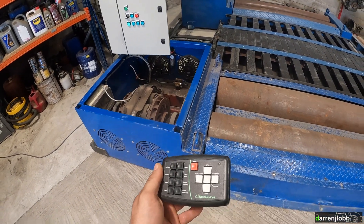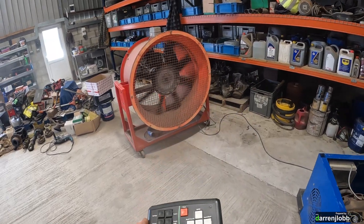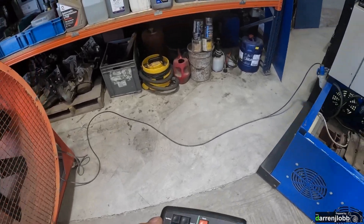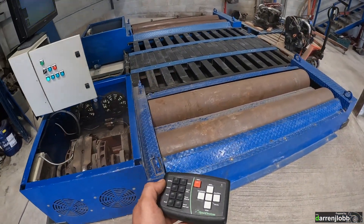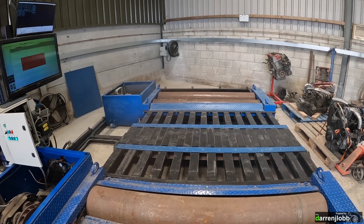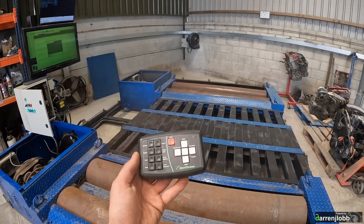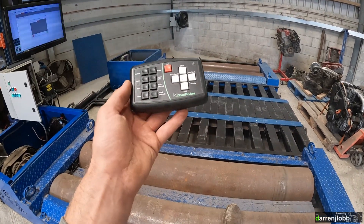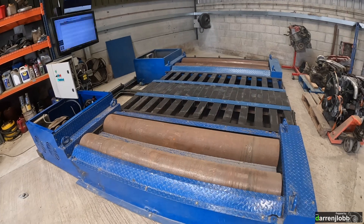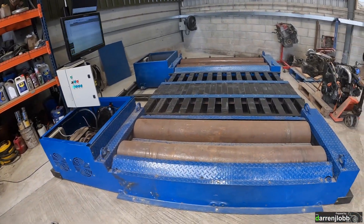The idea is, once you've got the car's wheelbase set, flip it to lock and there's no way you can accidentally activate the hydraulics with a car strapped on — they're really powerful and will bend or break anything. We've got the cooling fans for the retarders on another button — I generally just leave those on once the dyno's been running a while. The primary cooling fan for the car can now be turned on and off from the remote without getting out of the car. The exhaust extraction is also on a hotkey; it ticks over at low speed and when it senses roller RPM it ramps up to full power, then ramps back down when you stop.